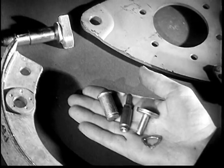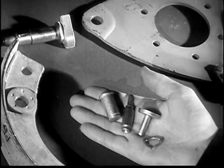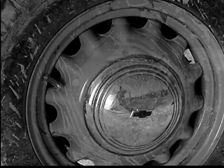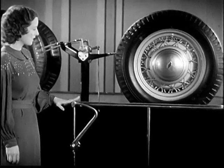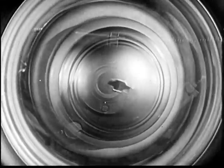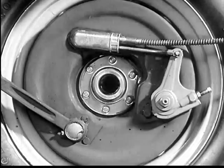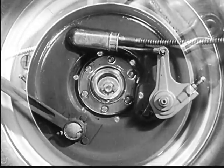For long life and dependability, all operating parts must be plated with either zinc, chromium, or cadmium. Such materials keep rust from weakening the brakes. These brakes are the finest you can get. The action of both the pedal and the drum must be mechanical regardless of what's used to connect them. Brake controls are very important, although too much emphasis is often put on that subject.